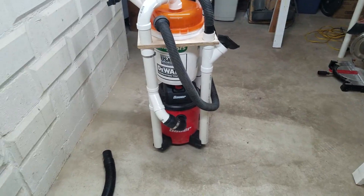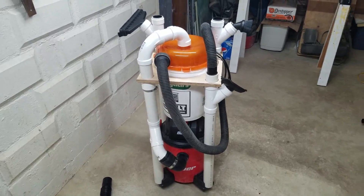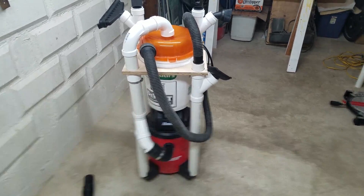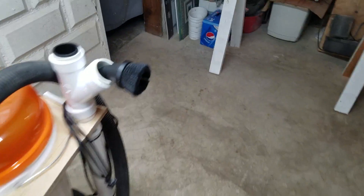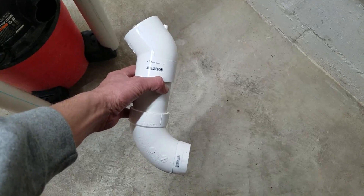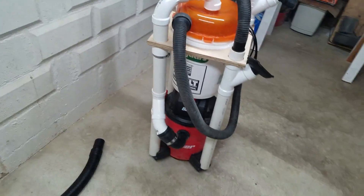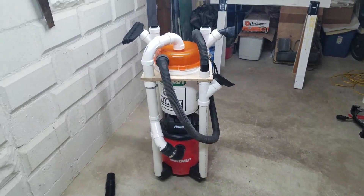This will be a dedicated shop vac — I don't see the point in getting it funky using it for other things when the whole point of this cart is to not blow dust around while vacuuming. I also don't want to be changing filters constantly. Speaking of exhaust — I don't have it on right now, but I made a 90 and a 45 to redirect the exhaust up and away instead of straight out the back, which anyone who's used one of these knows can blow the dust around that you're trying to vacuum up. Questions, comments — let me know, thanks for watching.